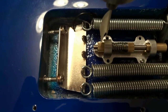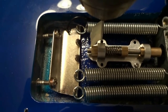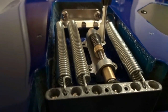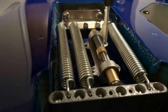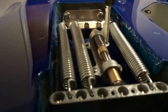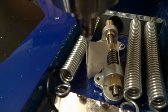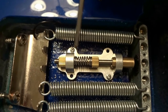Take your drill bit, line it up in the center of the second hole, and drill down until the masking tape touches the plate of the mechanism. Once you have that started, loosen the front screw slightly and move the whole mechanism to the left, then finish drilling that second hole.